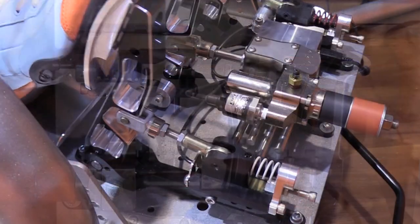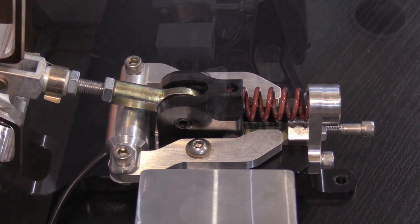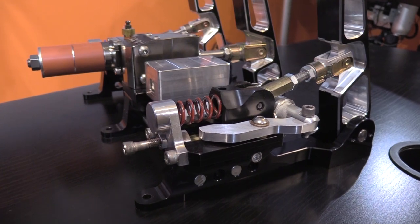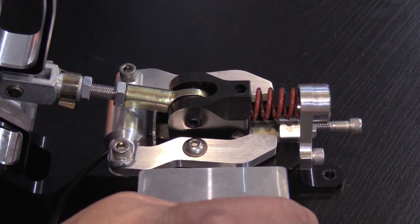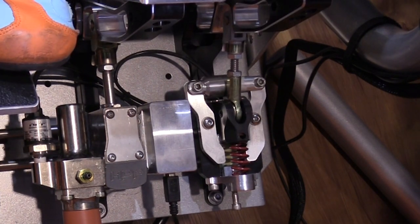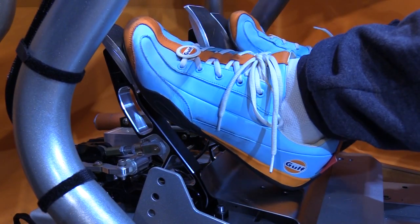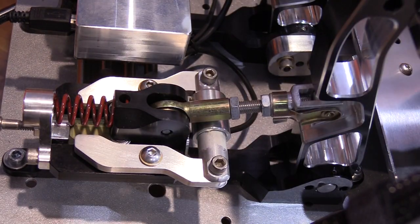The clutch pedal has similarities to the gas pedal — the arm, tie rod connector, slide mechanism, linear potentiometer, and spring for travel resistance are the same — but the clutch then has a whole other apparatus attached. It is a double-pinching cam mechanism that provides a three-stage feel, including a release-point feel modeled after a real-life clutch pedal. When pressed, the initial resistance is a bit of free travel, followed by the second stage when the clutch plate spring engages, and then the third stage when you overcome that spring and feel the release.